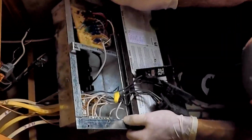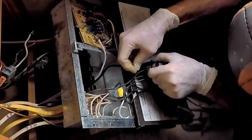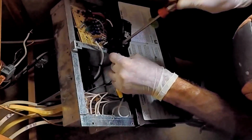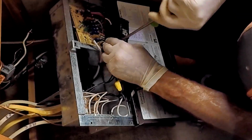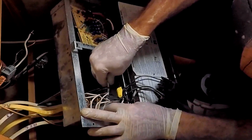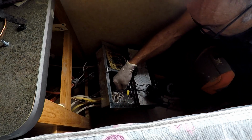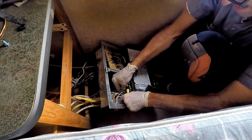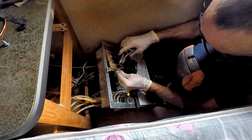Alright, so now I can hook these back up, right? Main power to the main breaker. You guys can see that, I don't know. Main neutral to the main neutral bus bar. Like there's an auxiliary neutral bus bar. This one they soldered together pretty janky. Let me just cut off that jank bit a little bit.